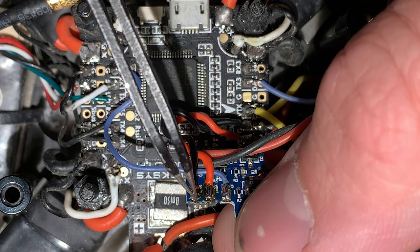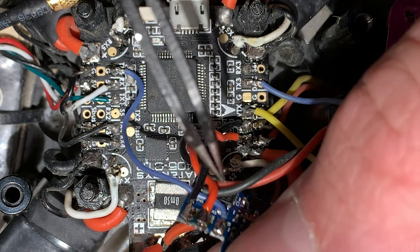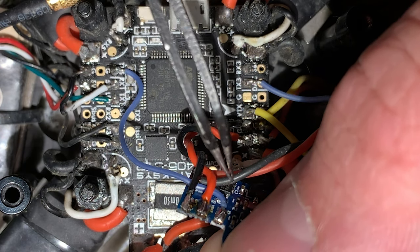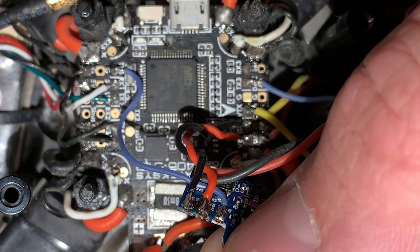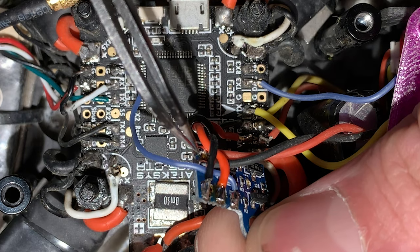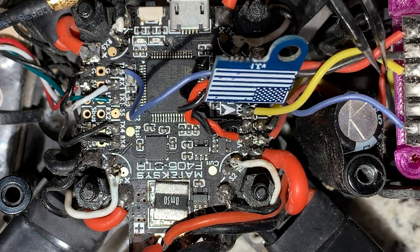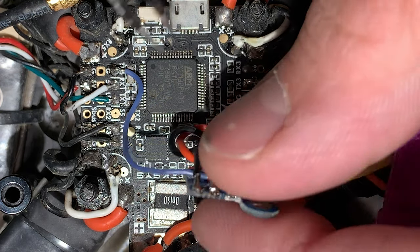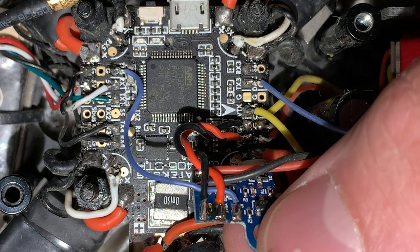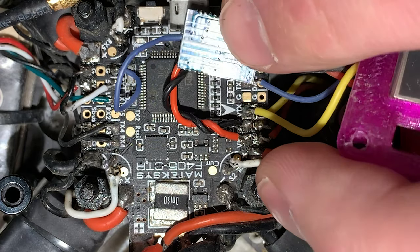So the 3-pin side is all your flight controller. That's everything that's hooked to your flight controller. Positive negative going into the positive negative on this side, your transmit or TX pad going into the IO pad on this side here. It's kind of snuck behind here. You can see my negative and my positive going to my VTX are sitting there. So that's how you'll get your power to your VTX, is going to be the two pads at the very end here. I have mine just all tidied up because that's me and how I like to get my builds. They're nice and clean-ish. We'll go with clean-ish.